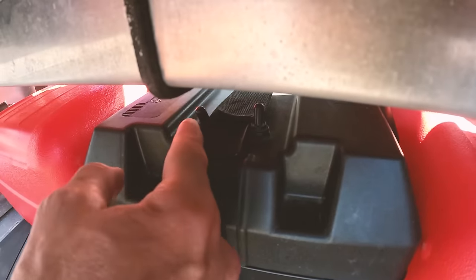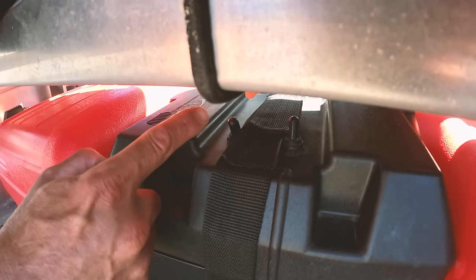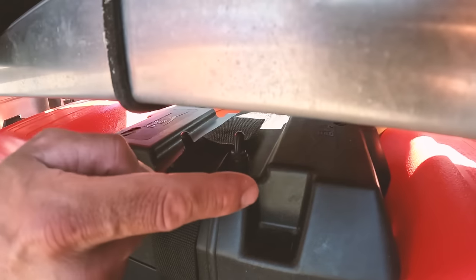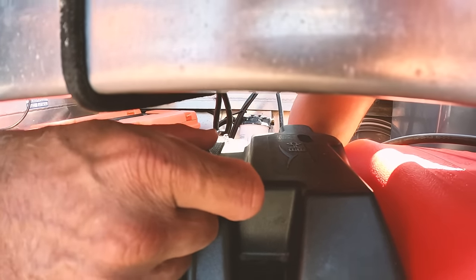Oh, I put all my switches. I only need two switches. This one controls the sounder, the NMEA system, and the radio, the VHF. And this one simply does the bilge pump. So if I flick it, you can hear it turn on.